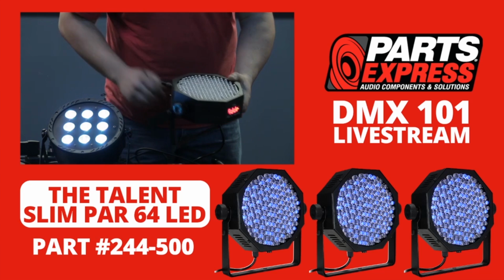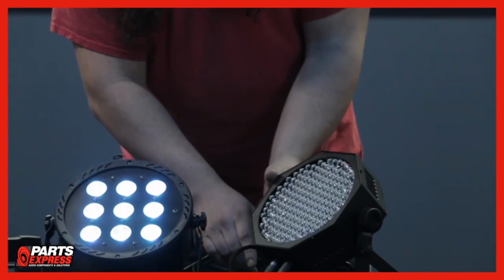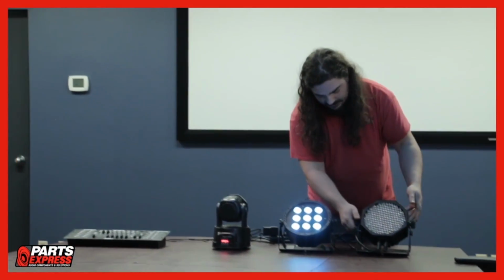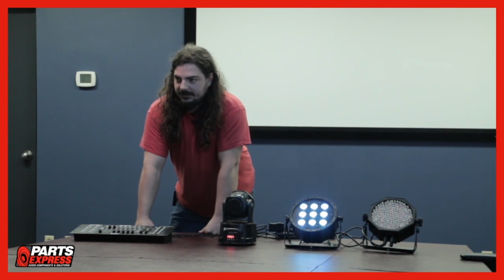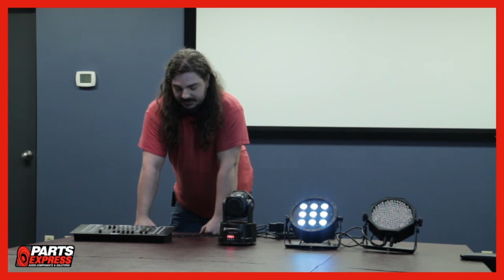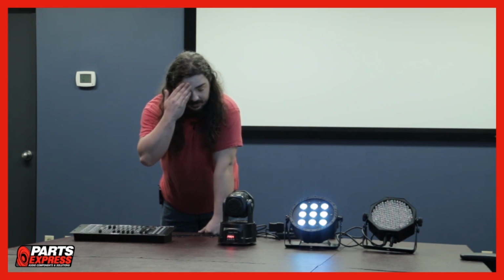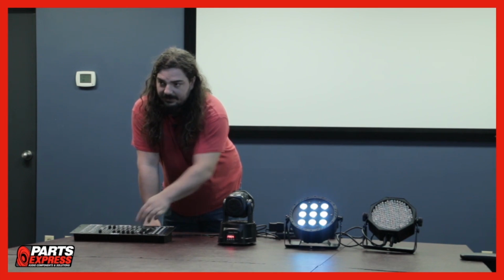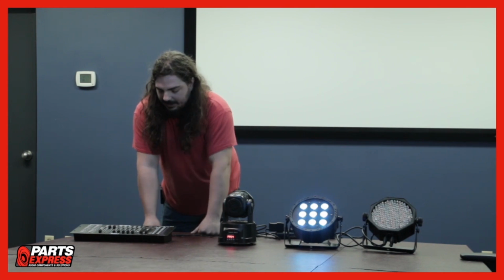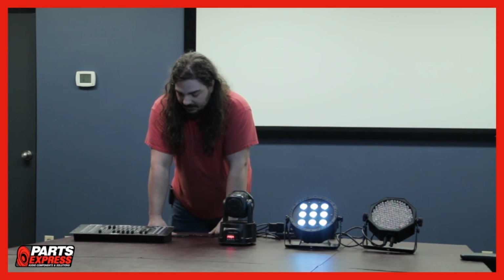And again, every light's going to be different, and every manufacturer makes it their own way. But the critical thing, I think, is keeping track of how many channels you consume and where you're starting to see offsets coming in the field. Yep. Which you want, like when you set it for RGB to match the channel. Yep. Which you absolutely can do. Some boards are capable of actually reassigning the faders on the board to make it line up. So I could have this one have the first two channels move down to the end so that all the other channels could line up with it. I don't think this one's capable of doing that, but a few of them are, and that's always an option.